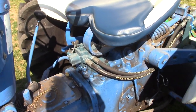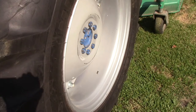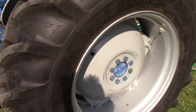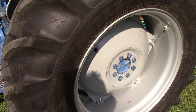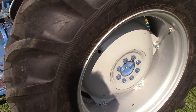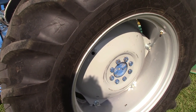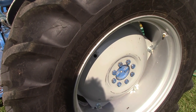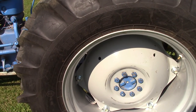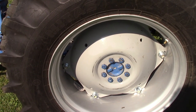This is the other side of my hydraulic remotes and they go back to there. When I got this tractor originally, the seal on this side was bad and it leaked all over the brakes, so the brakes wouldn't work. I took the wheel off, took the brakes off, took the axle out, and put a new seal in there. Put everything back together and actually got the brake on this side to work better because the pedal was seized up. The thing to remember with these brakes is when you take them apart, take a picture with your phone so that when you put it back together you get your springs back in the right order.